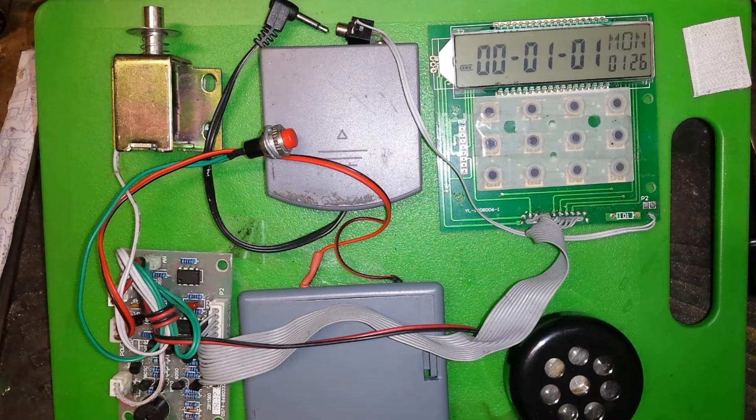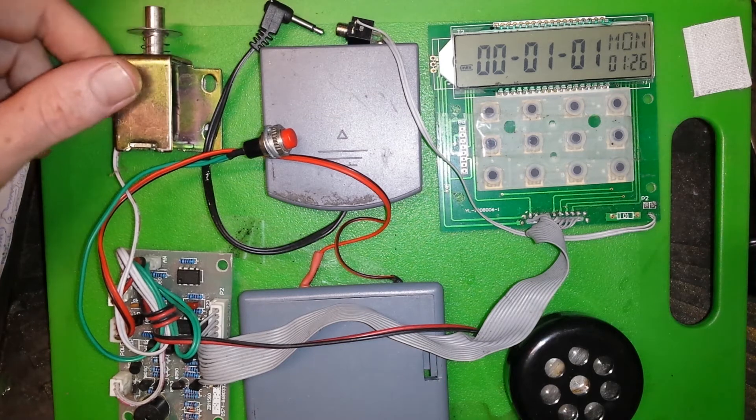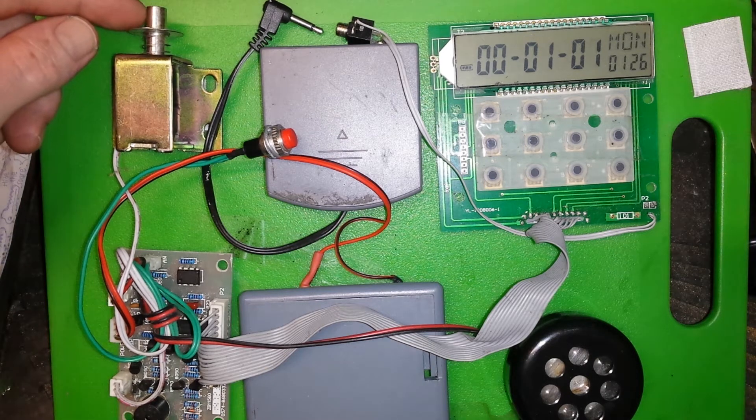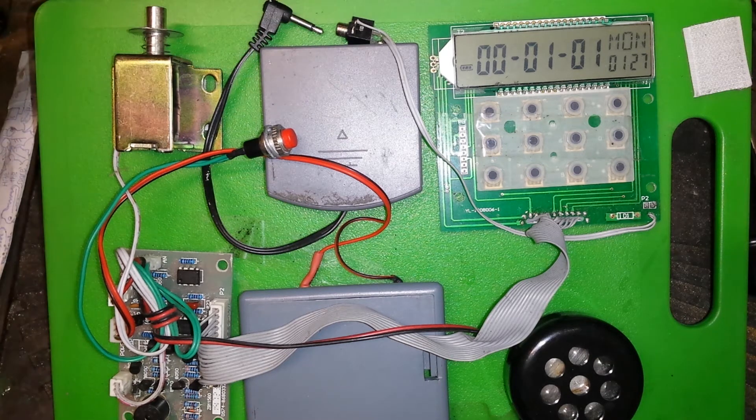Let's get on with the simple electronic bypass. Everyone may have noticed a solenoid at the top. Effectively, if you'd picked both the locks — which I have, which is why the safe is in many pieces — you'd know that having the locks picked, this solenoid would still be blocking the actual locking mechanism.